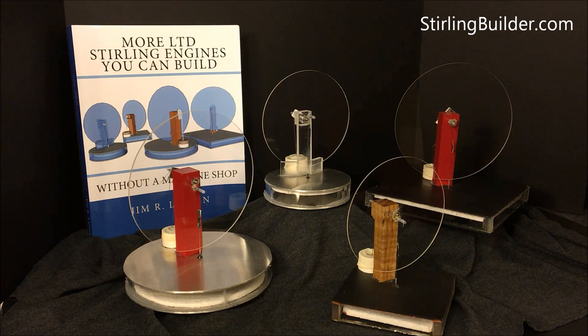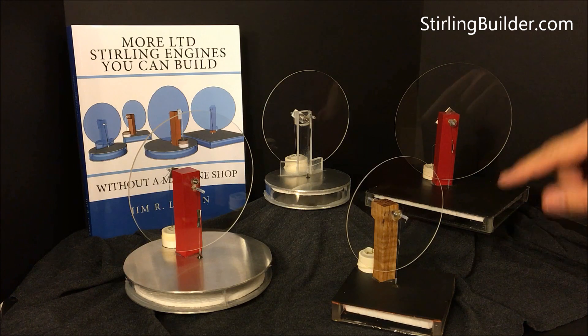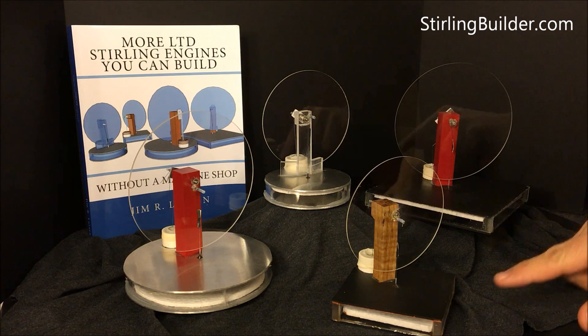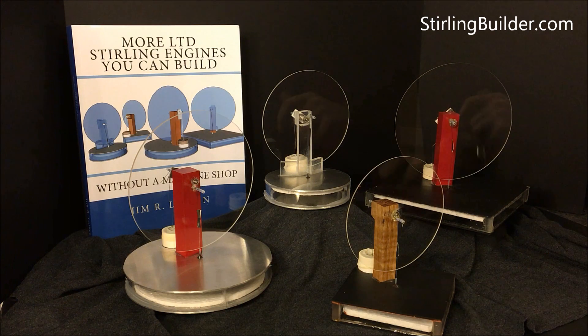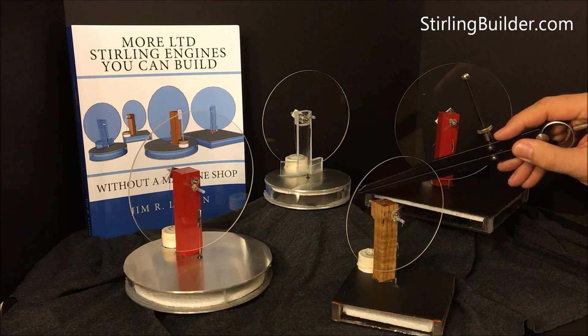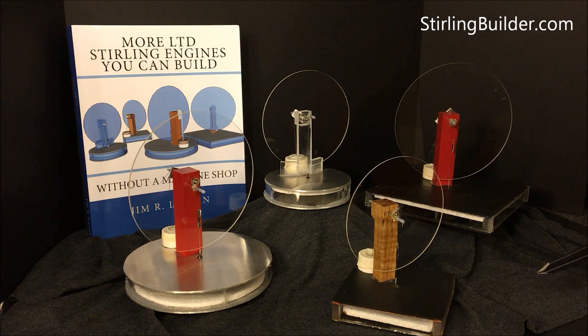Some of the unique challenges that you'll learn how to overcome in the book: I'll show you how to make a circle cutting jig so that you get a nice true round flywheel that really makes the engine look sharp. I'll give you some hints and clues on how to deal with acrylic — both for straight edges, which makes the engine quite easy to assemble, and for those who want the traditional round engine, I'll show you how to curve that acrylic. There are lots of hints and tips on working with acrylic. In fact, you can even see one of the pedestals is made of acrylic.